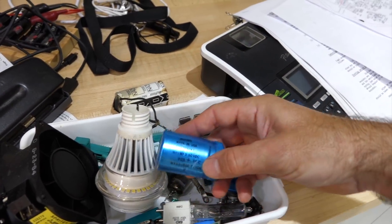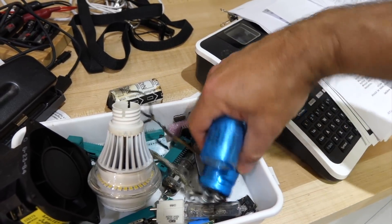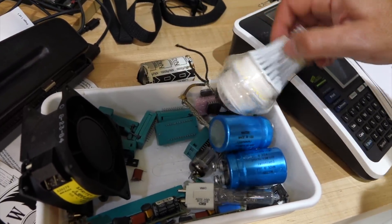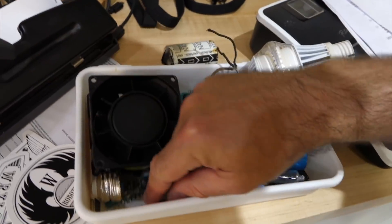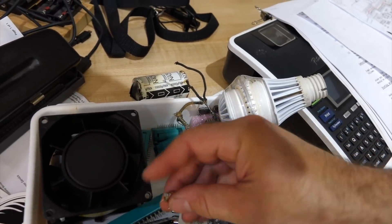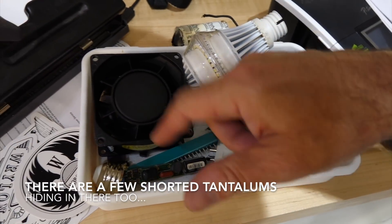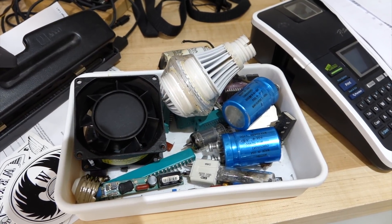If you look at my pile of old parts here — not to say we never have a bad one. That one is actually from a modern device — my NAD amplifier that almost caught fire, something from the year 2000. Here are some vintage ones: a 500V DC, 800 microfarad — I changed those two. One was not leaking but had low capacitance; the other one was good but I swapped it while I was at it. I also have a few film capacitors — sometimes they go bad. Capacitors really aren't that bad overall.